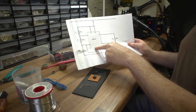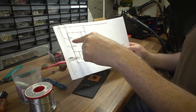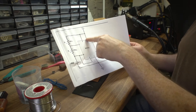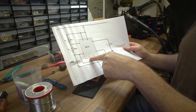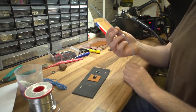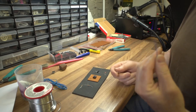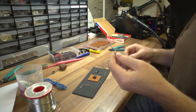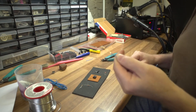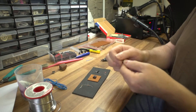Pin six and pin two need to be shorted together, and also pin four and pin eight need to be shorted together as well. So there are two shorts to do. What I've got is just some standard hookup wire - not stranded, it's solid, single strand if you like. All I tend to do is strip it - there you are - and we can use this for interlinks, which is what we're going to do right now.